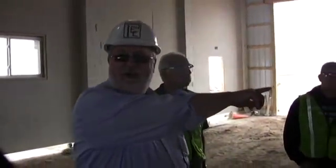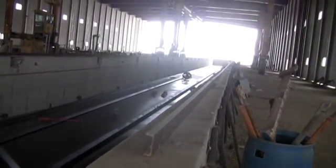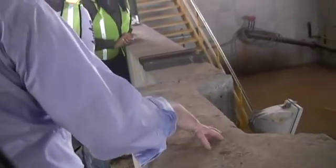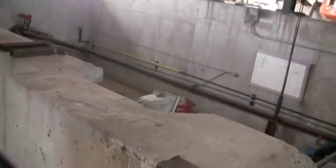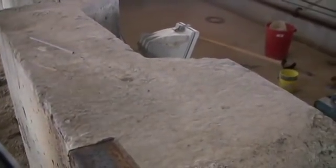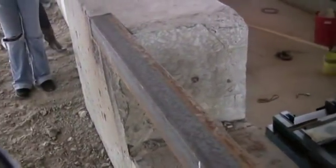Remember I told you the difference between precast and pre-stress. Pre-stress now has the wire in the concrete. We take pre-stressing strands, and on those particular beams they had 20 strands per beam. Stretch it all the way down to that end. And they have a bulkhead that sits down there and a cross piece that sits between these braces on the wall. This wall is designed to handle over 3 million pounds of stress. This wall goes into the ground about 18 feet. Inside this is a series of I-beams and tube steel and things like that that are constantly bracing it, because we're pulling like this, the steel, and we're putting all the stresses right at this point in the concrete. And as you can see, it's held up pretty well, that you're not having cracking or anything else like that.